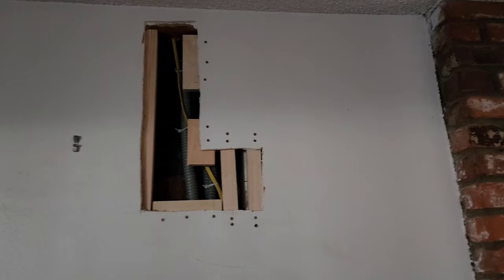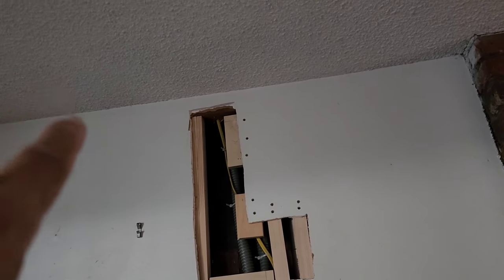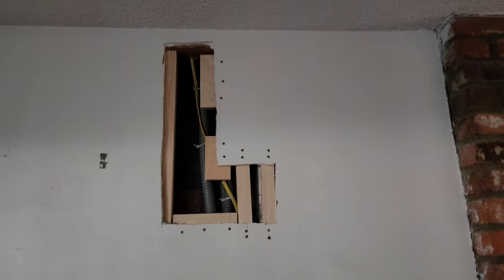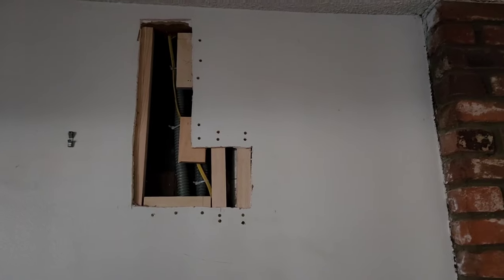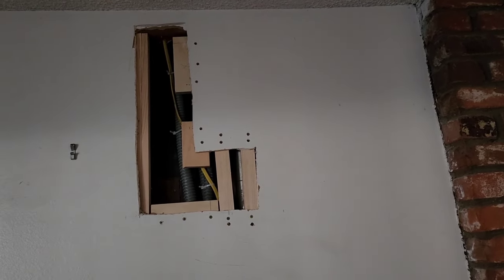Also, I was just talking to Vinny. Vinny said he put two staples right on that top rail. He put one right where it comes over with a little bend. And then, of course, before he made the turn, he put another one. So that's all I'm worried about. If somebody trips on the cable up there, it's not going to pull this one bit because he's got two staples right where it comes out of the top plate. And so it ain't going to go nowhere.